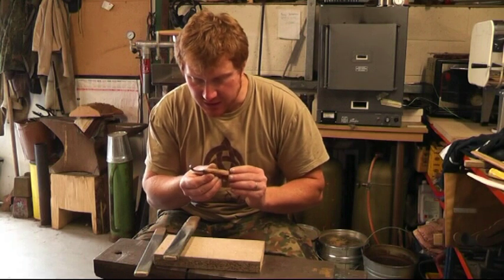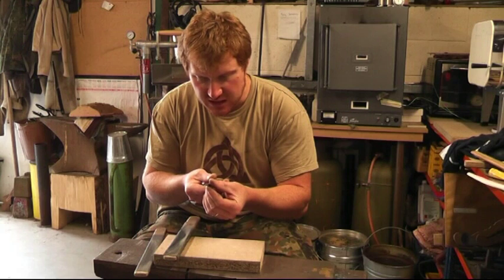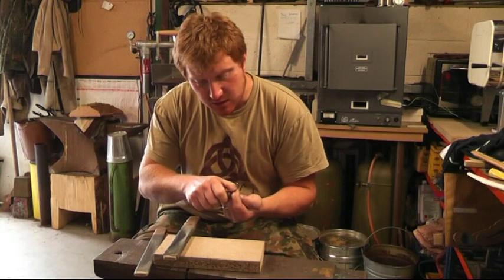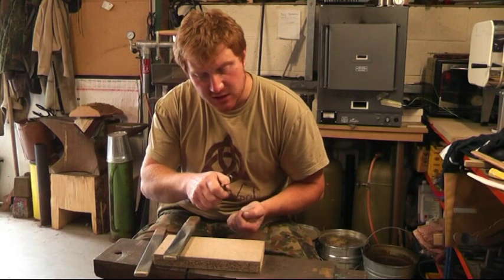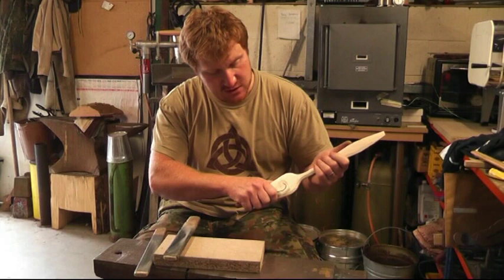So I'm pretty happy with how that's looking. You can test it by very, very carefully touching your thumb onto the edge and just dragging it slightly so you can feel it bite into your skin. Never run your thumb along it, because that will open it up really nastily. The other way that I sometimes do is I just test it on my fingernails, so I hold it on a very, very acute angle on my thumbnail — if it slides off it's dull, if it bites we know that we've got a nice sharp edge. The best way probably is to actually get one of our spoons and actually give it a bit of a test run and see if it slices nicely.